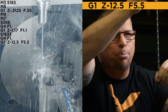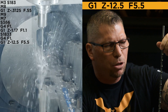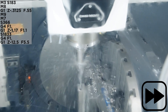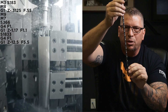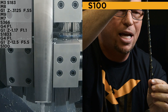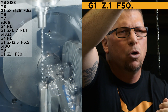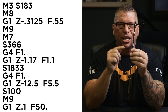There is no stopping now — we're just going to plunge all the way down, feeding at 5.5, 40 times diameter, breaking little chips all the way down in stainless steel. Once we break through, you'll see the coolant start blasting through the bottom of the hole. At that time I'm just going to slow the drill down to 100 RPMs, turn my coolant off, and bring my drill out of the hole at 50 inches a minute — nice and cool. We're ready for the next hole. And that is exactly how I hand-programmed this SGL drill.